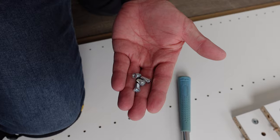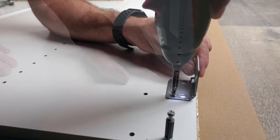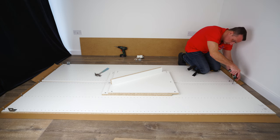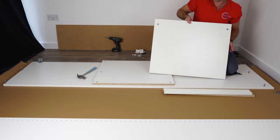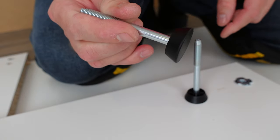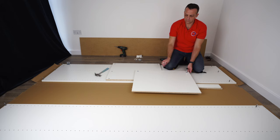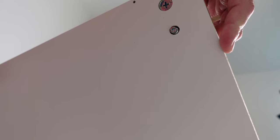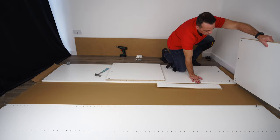We have those brackets and four screws if you want to attach the wardrobe to the wall. Even if not, put them in so maybe in the future you decide to do it. At the bottom, it's the third hole from the bottom — three screws on each side of this panel, secured just to the stopper. The adjustable legs: one part plastic, one metal — join them together and secure the legs into the brackets. Go all the way in and from the other side you should be out about two millimeters, so when you lift the frame you won't break them. Then later on you adjust them.